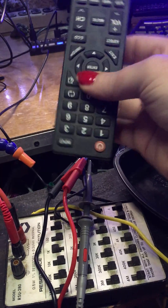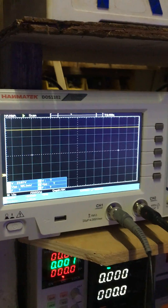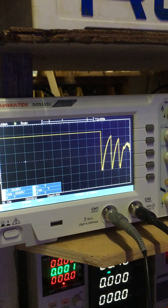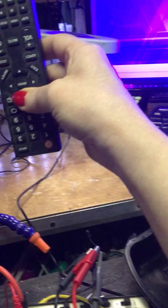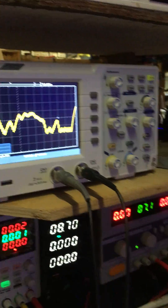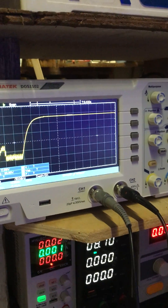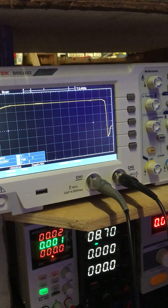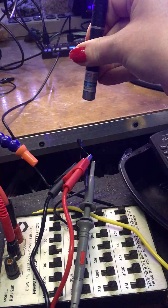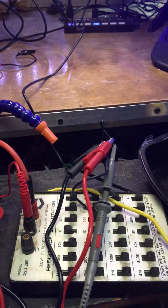It's an infrared photo diode — you can see we're flat line right now, but if I hit it with a beam you can kind of see the response as I drift the beam over it. With a remote control there's actually a frequency you're seeing. I can also hit it with a violet laser diode and it'll respond to that. It seems to respond to all colors — red is actually the one it's least sensitive to, but that's probably because it's a lower output diode.